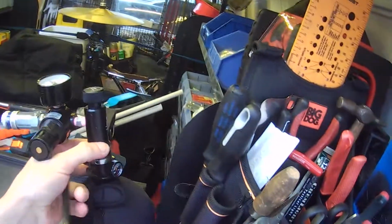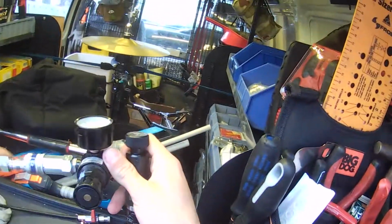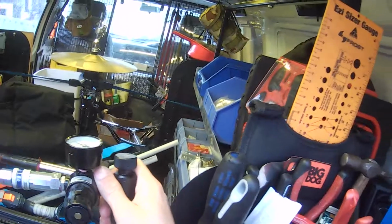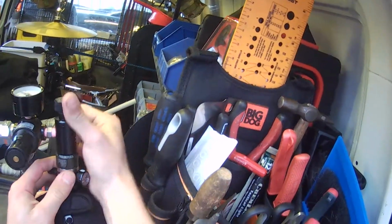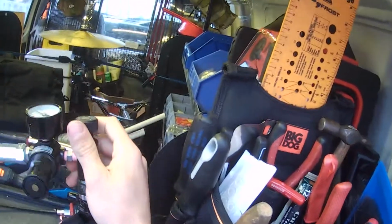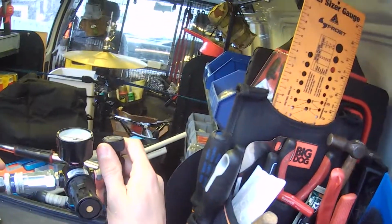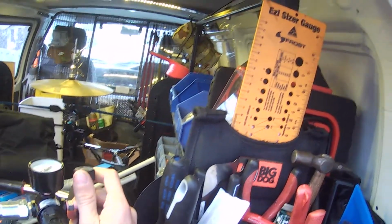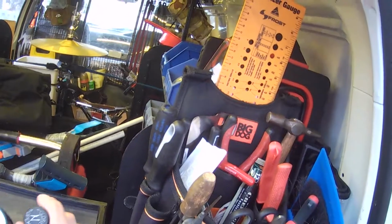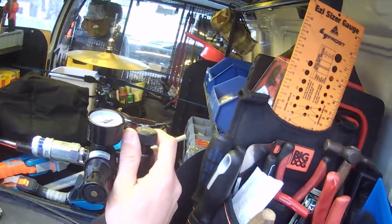Now, to turn it off, I'm going to plug this back in for a second. So we'll get the connect. So plug it in, and basically, if you want to turn it off, just untwist this. This part will still be pressurized, so again, you have to depressurize it sequentially. However, you can jump straight from 1 to 3 in this sequence, and you go 1, 3, and you'll just hear a slight hiss of air, and you'll see the pressure gauge drop back to 0. Nice and easy. Then you can still kick this out as needed, and you're all good to go.